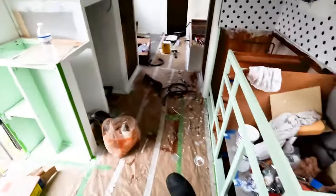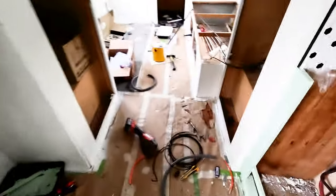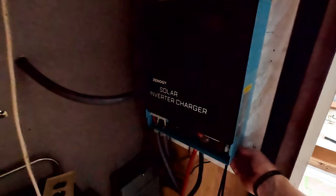Okay, so this has been a mission today trying to work out what I did wrong. I should have been setting it to a 48-volt array because that's what it says right here — 48 volts — and instead I set it to 24 volts. But now we don't have an error code or a fault, no red lights. 51... 52... 52.5... 52.6 — no error codes! Man, that's a win!